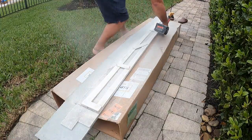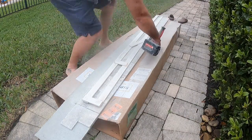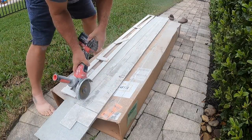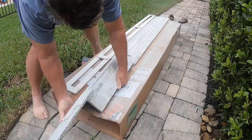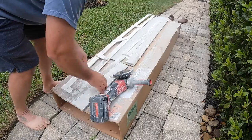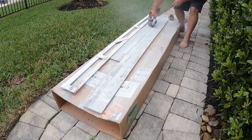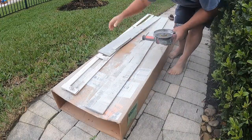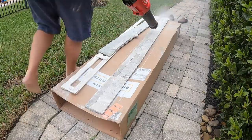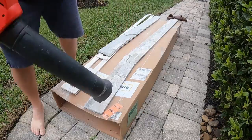I also went around the entire thing with the saw and cut it on an angle — not quite 45 degrees, but I did angle it in because I didn't want the concrete board to touch the granite at all. I wanted the stone to sit as tight as it could on the granite. I did the same thing to the other side — cut it on a 45 so it wouldn't hit the bottom of the granite; only the stone would touch.